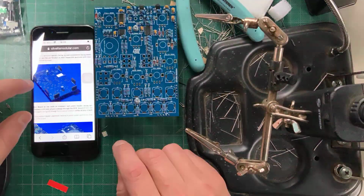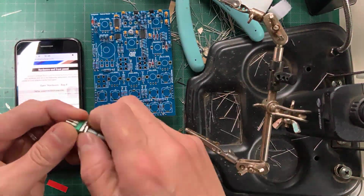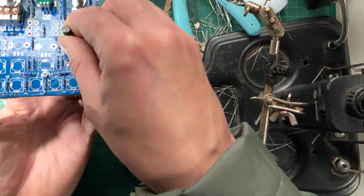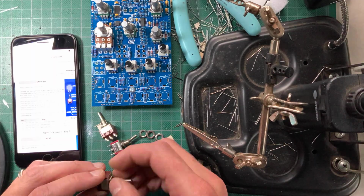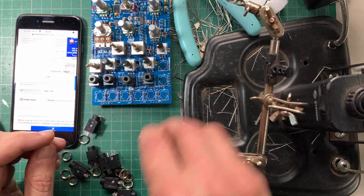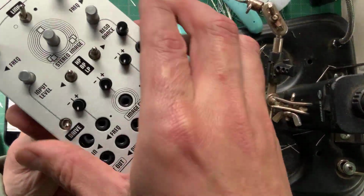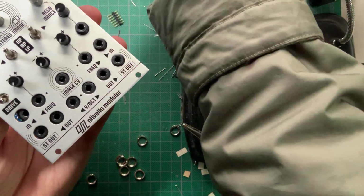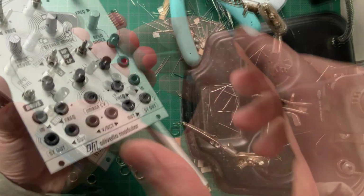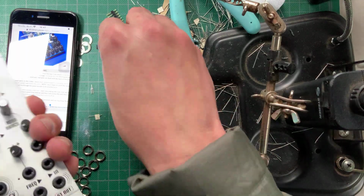We're getting there. Detach the boards again and start plugging in the pots, jacks and switches, without soldering yet. Next, fit on the panel and proceed to fit the washers and finger tighten the nuts. Be careful, remember these are not soldered yet. One false move and the jack or pot can slip out of the PCB and you'll have to remove the panel again to fix it.